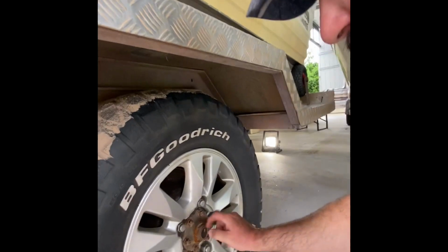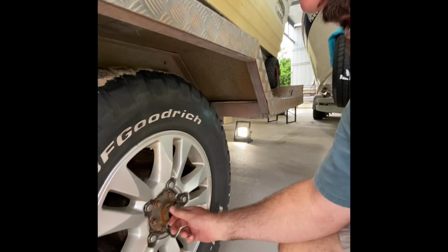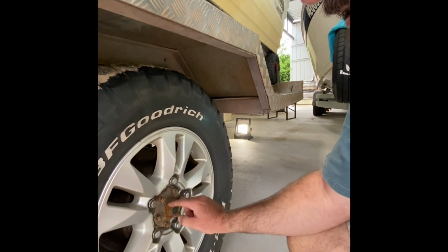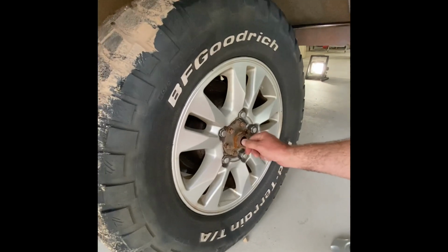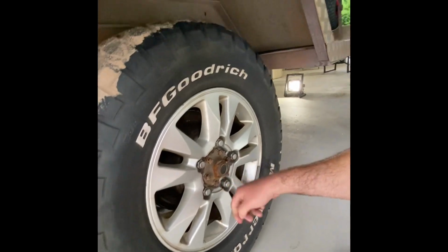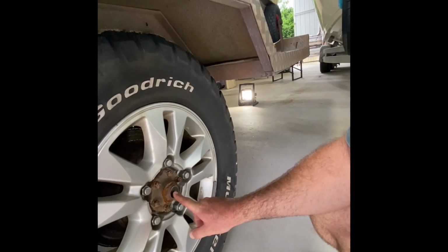This is the 100 series live axle spline thing. I machined that out the end, out of the spline, and then put a sight glass in there. So these just run Mercury. I just run Mercury or any gear case oil out of an outboard because it has saltwater inhibitor in it.